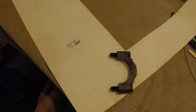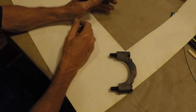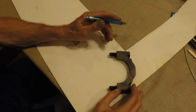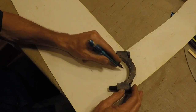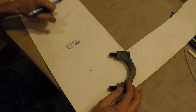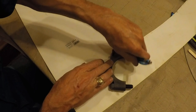The next thing we're going to make is a device to tap the shims in right alongside — between the carrier bearing race and the edge of the differential housing. This is the radius of those shims — they are the same radius as the bearing journal in the differential. We need a striking area, preferably 90 degrees opposed to the center line of this arc, and then some type of handle to hold this tool with. It doesn't have to be a long handle — we're not creating torque. I'm realizing I got this backwards, but it needs to be shaped like that — so let me go ahead and draw this down here.